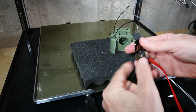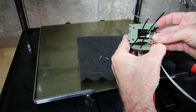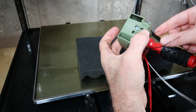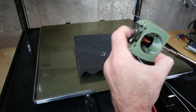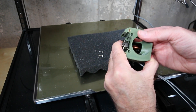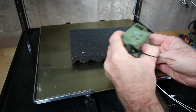I've also added the tie wrap to the part cooling ducts. Here I'm doing a test fitting and checking to make sure this all fits properly and I can route the cables as expected. Now I'm using the bolt to attach the hotend directly to the print head. Notice the small piece of PTFE tubing — I push it in flush against the back of the print head. The manual doesn't tell you how long to cut this. I cut mine to 26 millimeters based on my measurements, then used a little sandpaper to clean up the ends and ensure it fits properly.